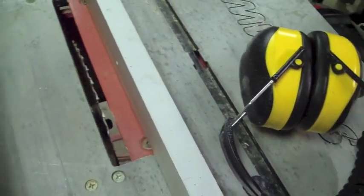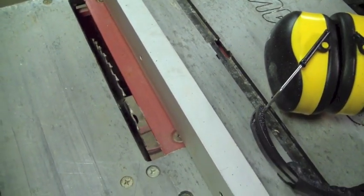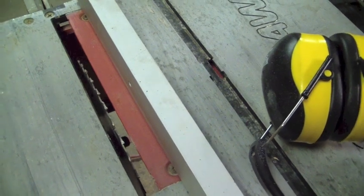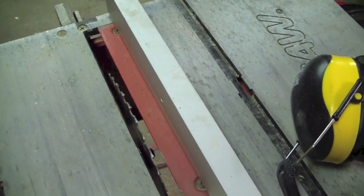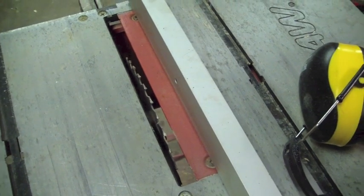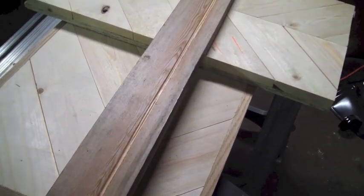To cheat this on the saw, I'm going to start by putting in some real thin wood and work up to thicker pieces until I get the right thickness — basically using my blade as a dado blade by putting shims between the fence and the board. Once I get the fence exactly where I want it for the bottom width, I'll reset and do the top width. I'll run all four boards through once they're done. Then I just have to auger out the middle — I might even use the router for that. Right now it's a lot of trial and error figuring out how to turn a regular blade into a dado blade on a warped board.